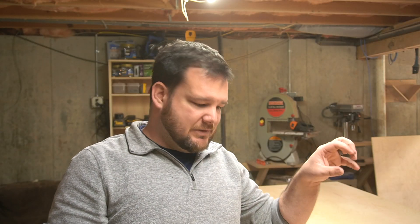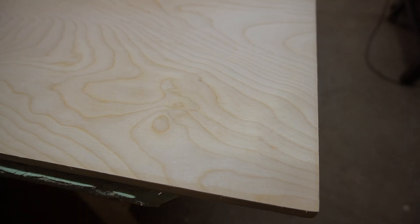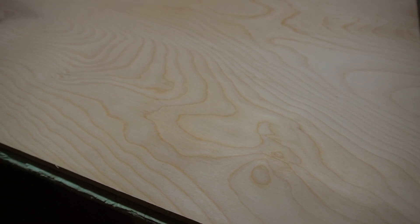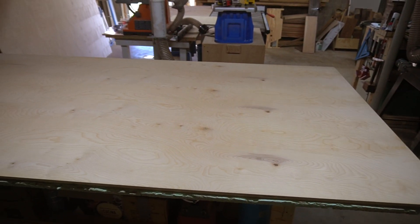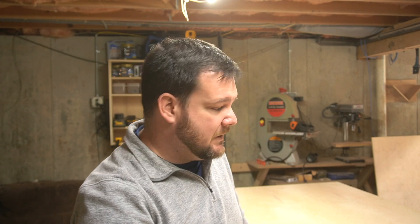For this project I'm going to be using half-inch material. I just got this from my local home store — not cheap these days. I paid $260 for three half-inch 4×8 sheets with tax. This is a high-grade birch-veneered plywood. I needed something higher grade because I'm going to stain it. If I was going to paint it, I could use a lot less expensive plywood, but here I wanted something where the grain looks good and takes a stain well.